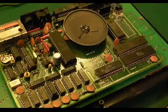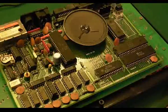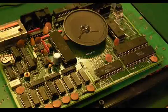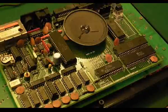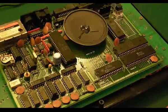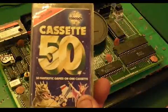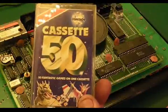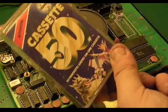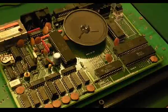As you can see, the computer basically now seems to be working. All I need to do is sort out the keyboard issue — the key switches all seem to be individual from the solder marks, so my next port of call will be to strip down the keyboard, clean all the contacts, and hopefully get it working again. Then we can get on to testing some software and games. I only have one legit piece of software for the Oric Atmos and it's the infamous Cassette 50 — 50 fantastic games on one cassette. As soon as we get this up and running I'll get my cassette player out. Thanks for watching — see you next time, goodbye.